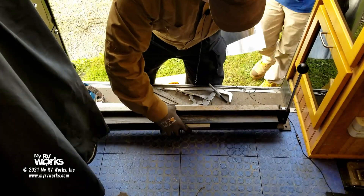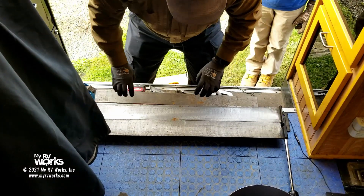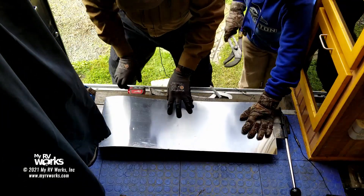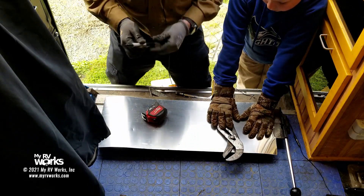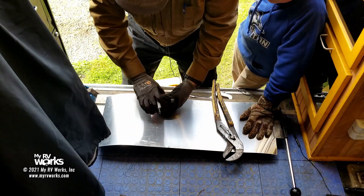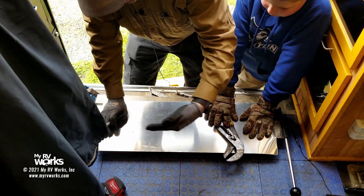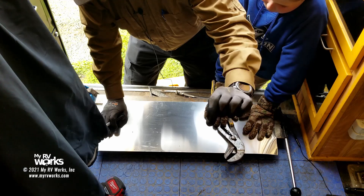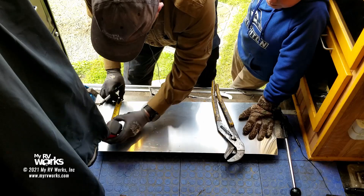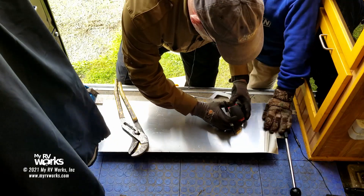This device here is a press brake — or brake press, whatever you call it. I'm sure I'll get comments. So we want to bend this thing. After it bends, we want it to come up six and a quarter inches. How do I know it's six and a quarter? Because I measured from the bottom of my opening to about an eighth or a quarter of an inch up to the fins — that was six and a quarter. So we're going to make a mark at six and a quarter. The beautiful thing about this type of flashing work is it doesn't have to be exact, because no matter how perfect you get it, you're dealing with air.